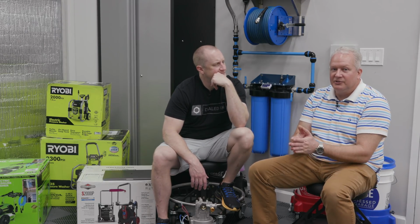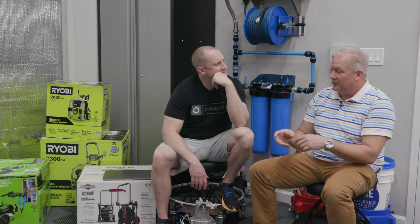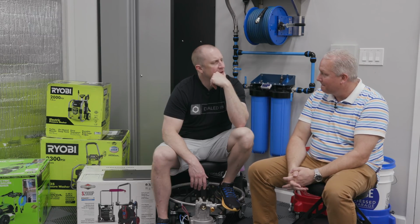So you're getting basically 6 data points. And again, you're going to do that on 3 separate units. So you're going to take the average of 18 readings to get your pressure and your flow.